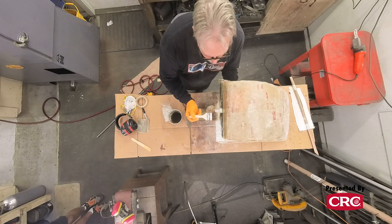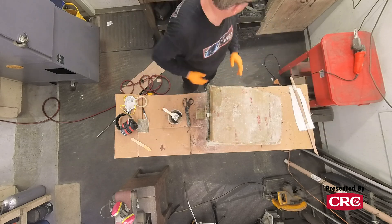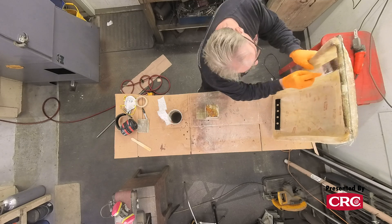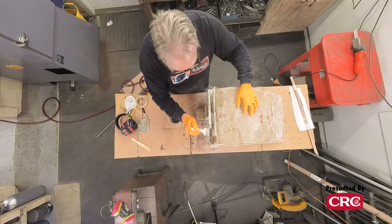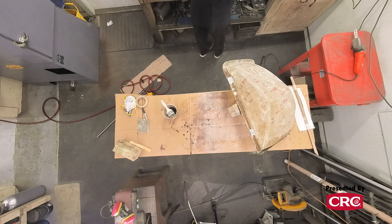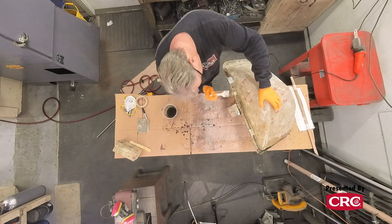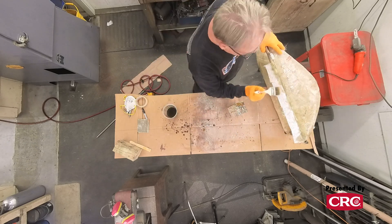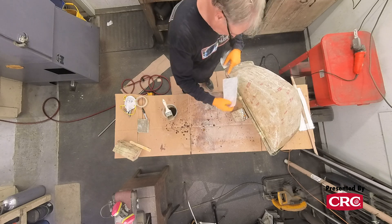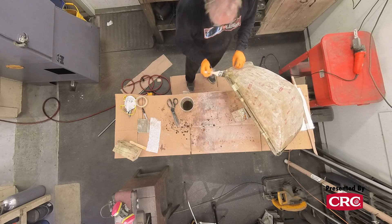We should talk for a minute about gel coat. Most fiberglass has gel coat on one side — gel coat provides a smooth surface. It's not a paint, but it's a paint-like product, generally used at the bottom of a mold. This seat is getting fabric over it, so once we sand it a little smoother, it's a moot point. You cannot paint over fiberglass directly. There are some modern primers that allow you to paint over fiberglass, but generally you put a layer of gel coat. If it's well done enough, that is your final finish — like a boat or most kit cars, which come gel-coated.